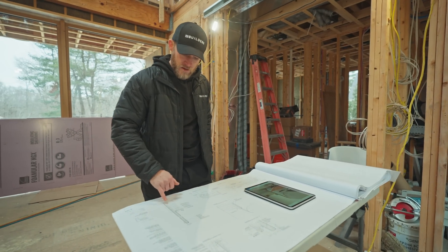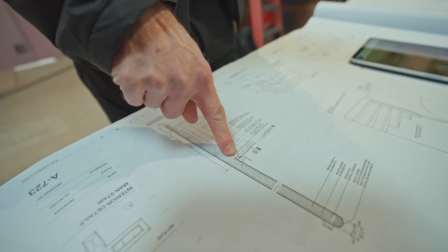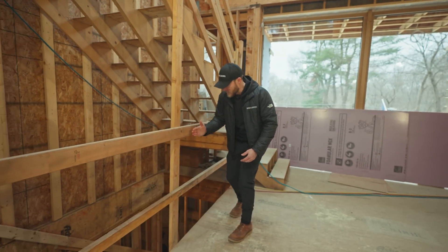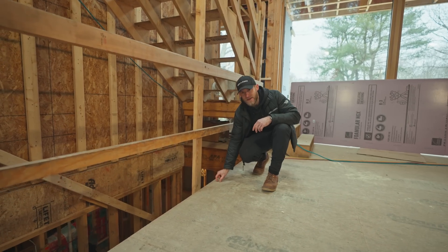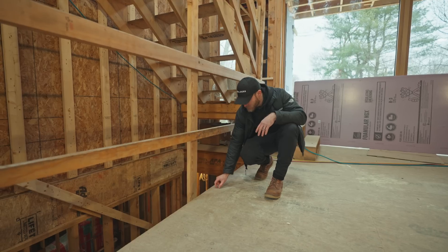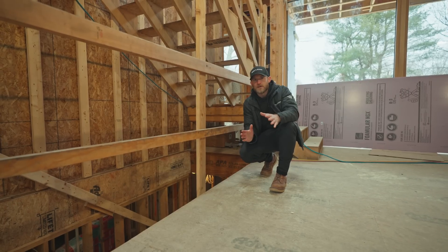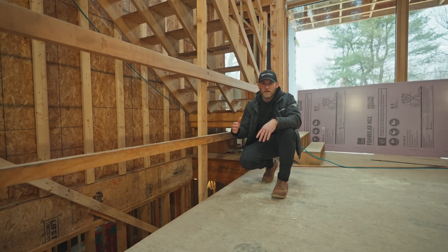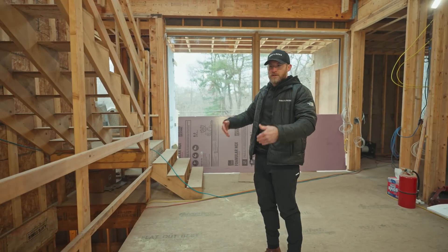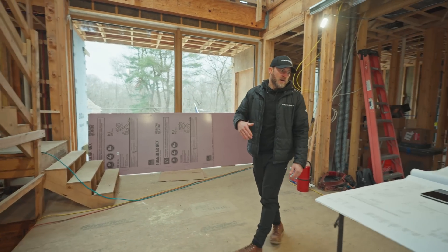You can see the double plywood wall bolted, and if you look closely you'll actually see that we have an up-light. Right at this plaster wall coming down, at the very bottom we'll have an LED tape light — very similar to what we put under cabinets or in a shower niche — but it will sit completely flush with our hardwood floor and then up-light the plaster. It's a very subtle detail but something that's going to add a lot of mood to this whole section. Being that this is raw plaster, as light sheds across it you're going to see a lot of movement, which is just going to accentuate the beauty of that plaster.